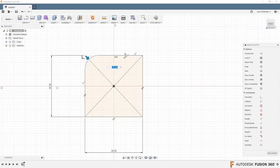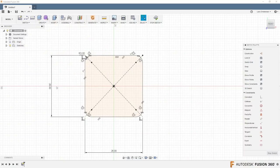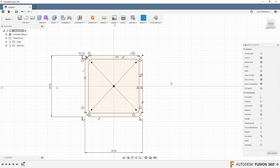But if I'm standing in front of a customer and they might say 'what if we change that fillet,' then I like to do it as a feature — that's my rule. I'm going to make these 3 millimeters. With this outer shape done, on the American version you can see it's white on the outside with kind of a gray center. I'm going to model this as a multi-body. I'll do O for offset, turn chain on so it selects the whole thing, and offset 1.6 millimeters.